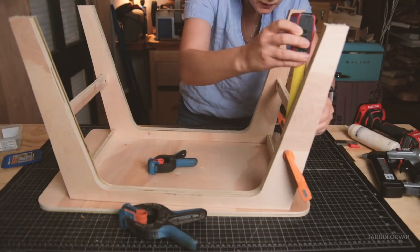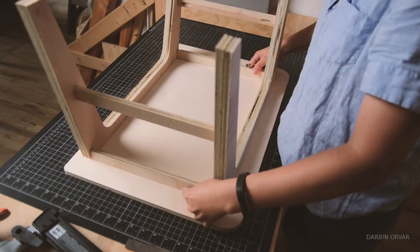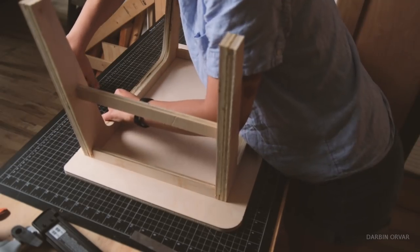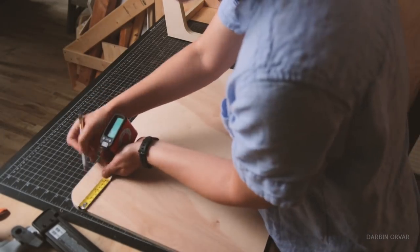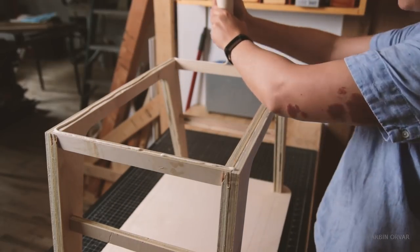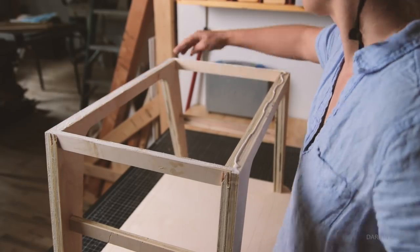These rails are feeling a little bit thin — definitely too thin to use with pocket screws, the ones going into the top. So deciding to just glue the base to the top. I'm measuring out here where I should glue it down, and feeling that it would be better to have this somehow fit into the top so there would be less guesswork.